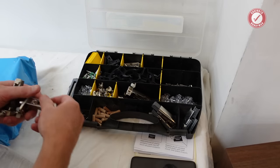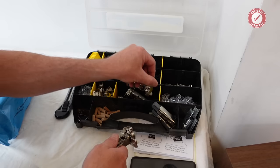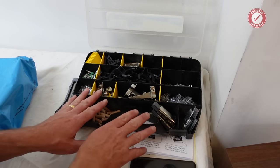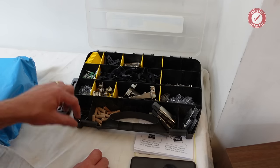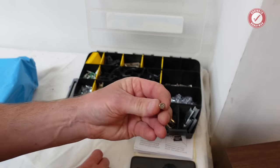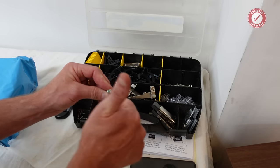It's so much easier just sorting things out like this and you can immediately kind of see what you've got and you're not then fussing around looking for a particular screw or fitting. The good news to start off with, I've never fitted one of these particular kitchens before and everything looks really good quality. We've got proper posi drive screws, not awful Phillips screws. And even the dowels for the cams are posi drive as well, which they should be.